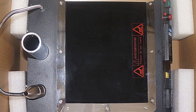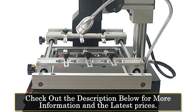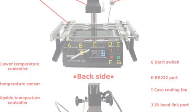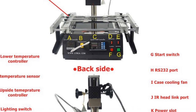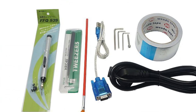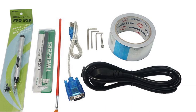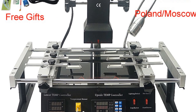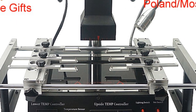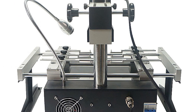Equipped with an IR heating system, the IR6000 500 V2 Pro offers precise and independent temperature control. The upper heating unit has a size of 80mm x 80mm and a consumption of 450W, while the bottom heating unit measures 240mm x 200mm and consumes 1,800W. The closed-loop control system ensures a temperature precision of plus or minus 0.5%, providing accurate and stable heating. The dimensions of the unit are L495mm x W480mm x H420mm, and the power supply requirement is 220VAC.